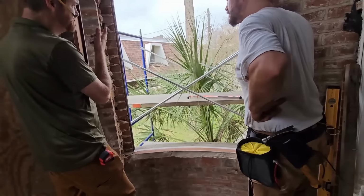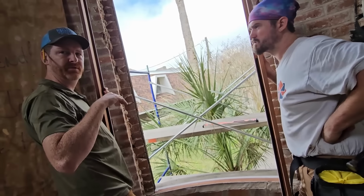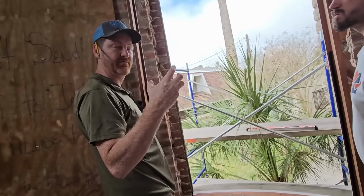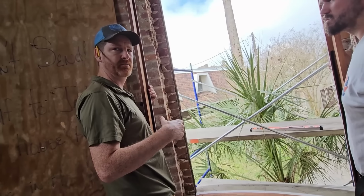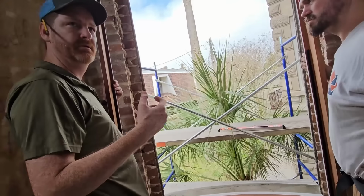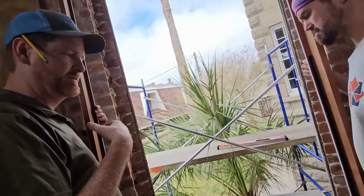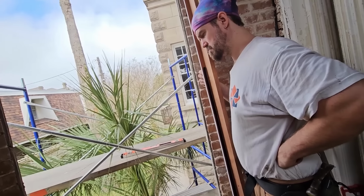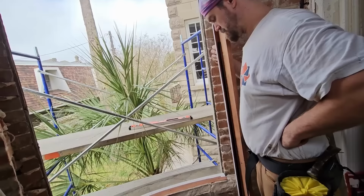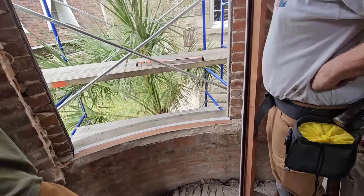You know, all the old houses, when they do the siding, they didn't paint the back side. They didn't do anything. And if you take a piece of cypress or cedar and you paint it all the way around, if moisture does get in there somehow, where's it going to go? No way out. So it needs the space to dry. Yeah, you know, almost it breathing from the backside. I'm gonna say is the only way to do it, but it seems like the old ways they love to do that. Well, the old ways lasted 100 and something years, so.